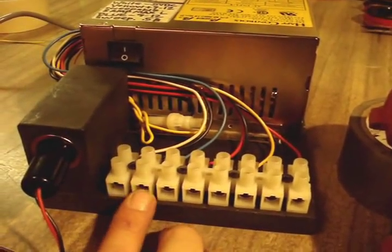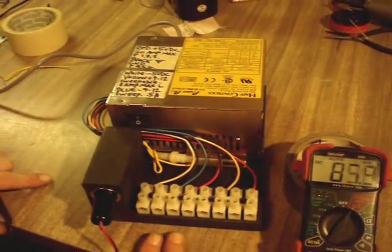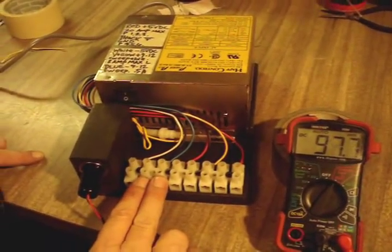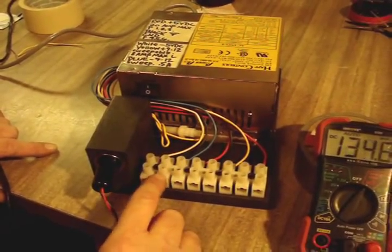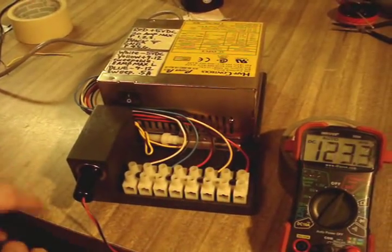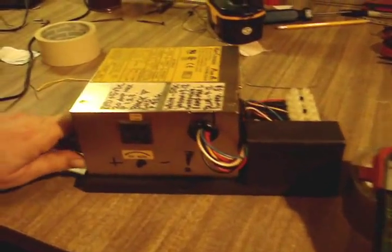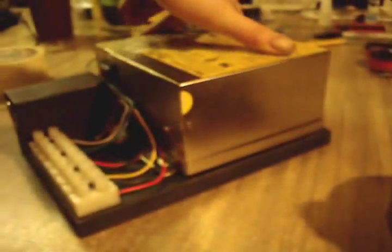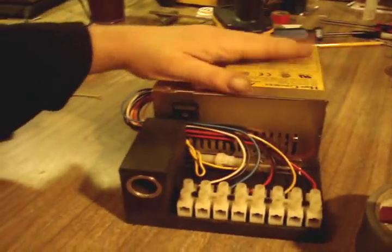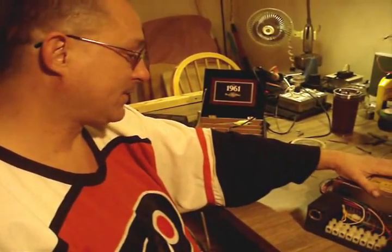It's a little confusing — you've got to be careful, you don't want to reverse polarity. If you're going to have a lower amperage application, you'll use the bipolar side, which is negative. You have to flip-flop: your blue would be the ground and the black would be the positive. If I need smaller voltages or light amp applications, I can tap into the white and black wires for reverse polarity. For 5 volts with more amperage, go to black and red. For 12 volts, black and yellow is high amperage output. This is something I've wanted to put together for a long time, and I'm happy I did. This wouldn't be a permanent solution — this is a testing unit for monkeying around. There you have it, folks: the hacked power supply.